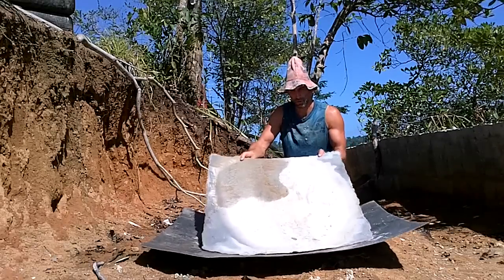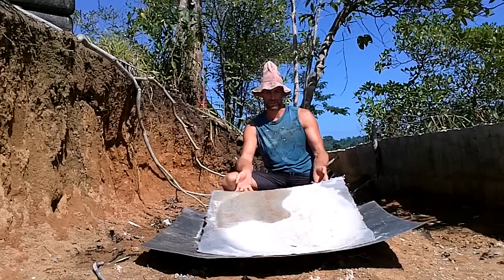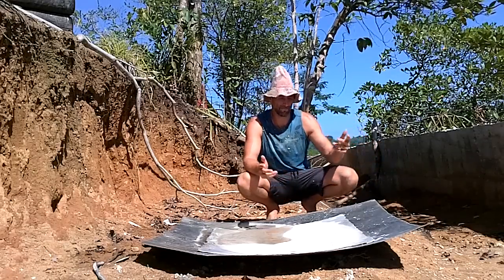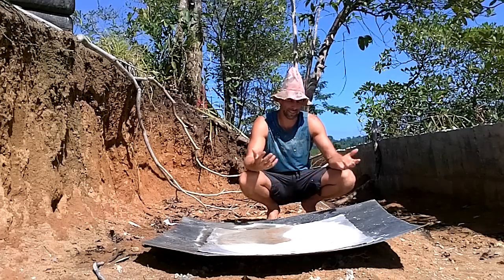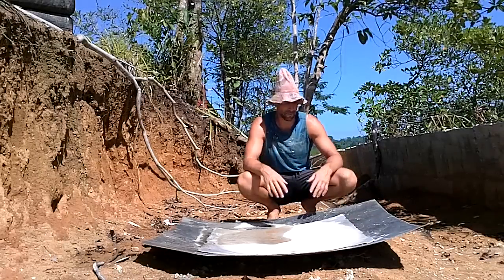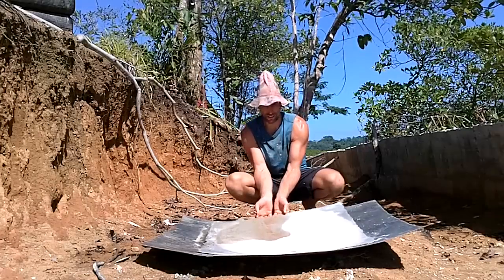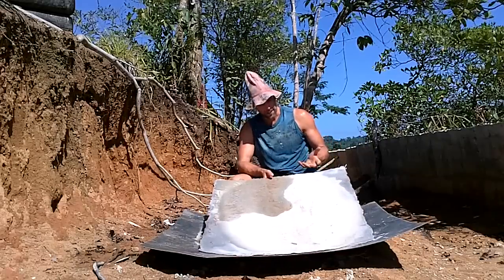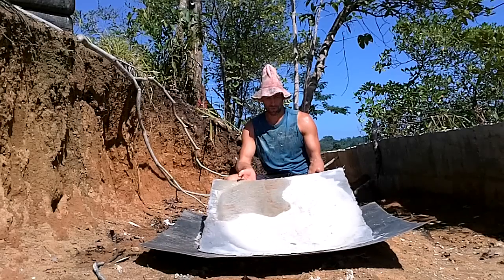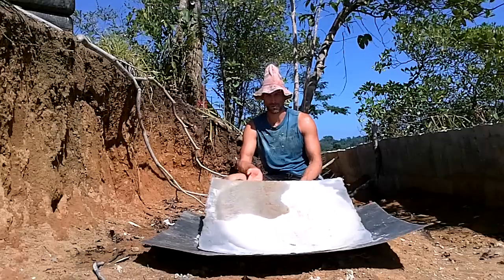But it's flexible too. Now this apparently isn't going to last because after I made this I did a little research and found that glass dissolves in cement — the alkaline environment in the cement dissolves the glass. Bottom line is the fiberglass isn't going to last, so eventually this will just disintegrate and fall apart. But it does show how strong and flexible something can be once it's got reinforced fibers in it, even something as rigid and brittle as straight cement.